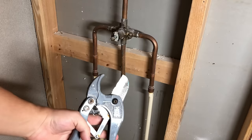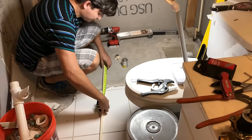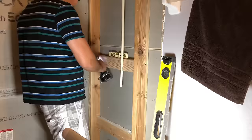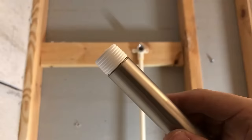Then I had to replace the copper plumbing with CPVC. I had to move the valve a bit higher since I'm making this into a shower instead of a tub. I know I could have used PEX tubing, but here in Florida it's common to use CPVC for plumbing. Check your codes in your state when doing any plumbing or electrical work — make sure you follow the code. CPVC was pretty easy to use and I was happy with the results.